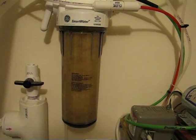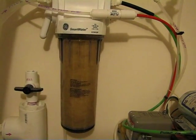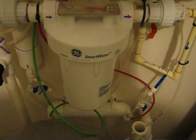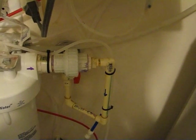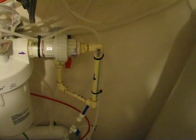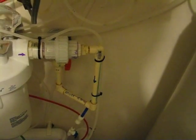Sometimes you'll see a four-stage system with two pre-filters. I'm using a larger whole-house pre-filter than you'd normally find on a small under-the-counter drinking water system. After the pre-filter, we have a post-filter — a carbon buffer — plumbed into the tank and into the house using CPVC. My whole house is plumbed in CPVC due to the presence of several bacteria common in my aquifer, which can be quite corrosive to copper and other materials. We do treat with chlorine, but it's a good idea to use materials that won't degrade under biological influences.